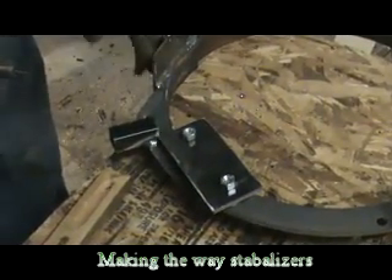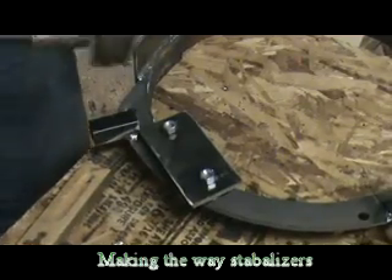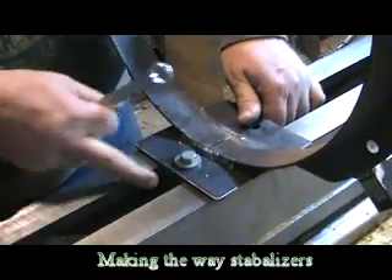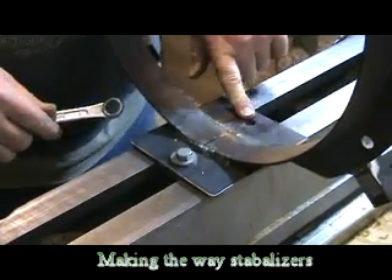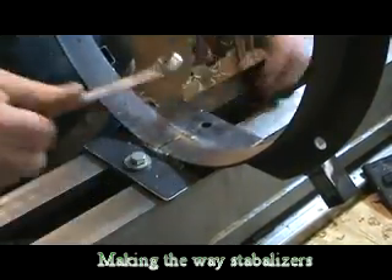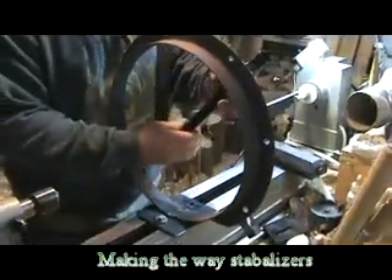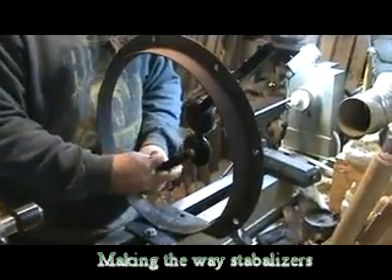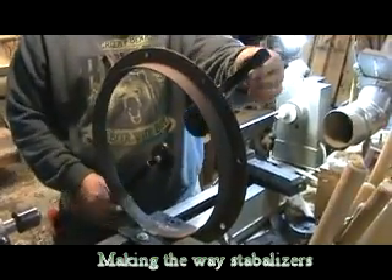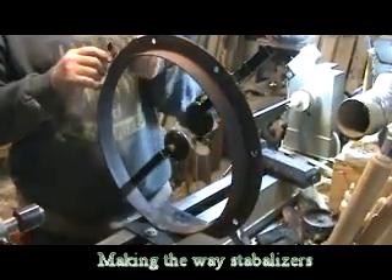The clamp that goes on the bottom clamps the steady rest in between the ways to keep it in place while you're turning your vase for a deep hollowing operation. It's in place, centered in my holes so I'll have clearance — I'll weld them on. Now we've got the clamper base down in the bottom. I'm missing a bolt here; we're going to get some with a hex head so we can use an allen wrench to tighten them up. It should be a lot easier — give it a couple of turns and it's solid. We can put the wheels in inside or to the outside; it really won't matter, they'll still do the job. When we get all four in there, we can move them in and out until we get the size we want. There's the basic finished steady rest — I'll finish the other two, put in my T-handles and we're done.